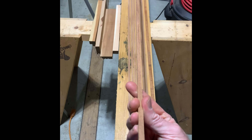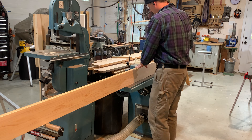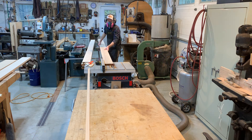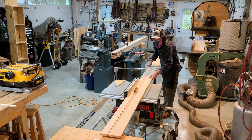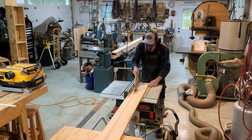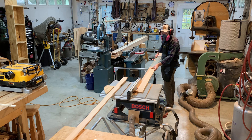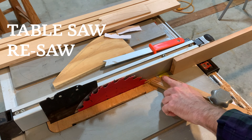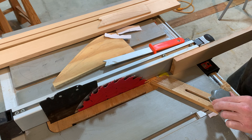Now the very center of the board, on the inside of those pinstripes, is red cedar. So I got a piece of very vertical grain red cedar, a little bit wide, and I ripped two rips out of it, giving me two smaller boards out of the big board. Then I re-sawed each of those smaller boards so I could have, again, another match set for the center.